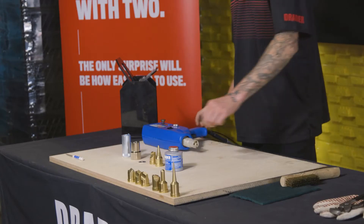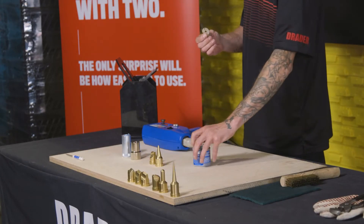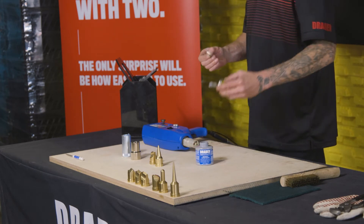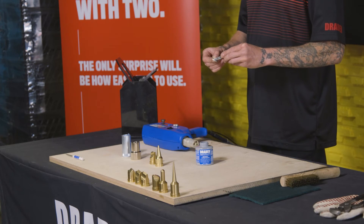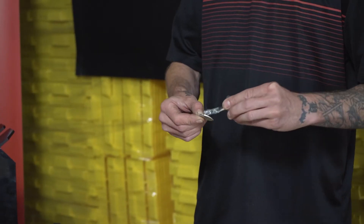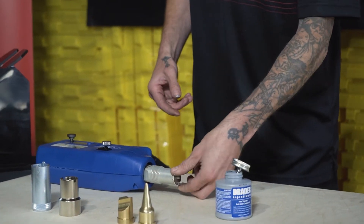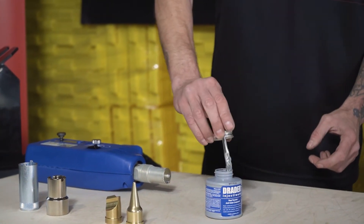What's very important is the barrel washer. That barrel washer helps to prevent any plastic from leaking through and escaping from the barrel. What we're doing here is putting some anti-seize and heat transfer paste on the barrel washer, and attaching it to the barrel.